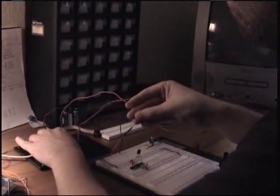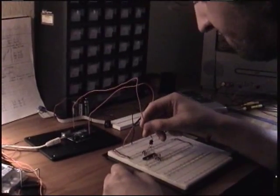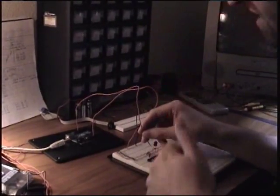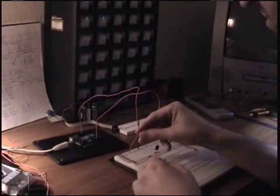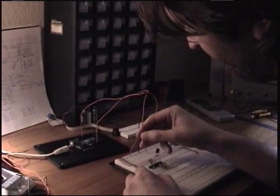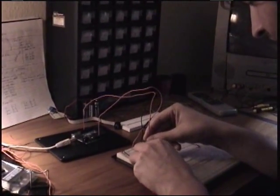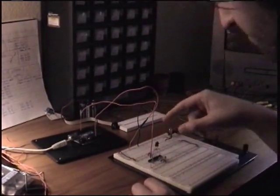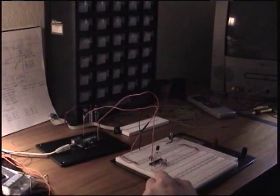And then, of course, as you know from the first tutorial, the reset pin on the actual chip is pin 1. Now, we have the resistor here, and I learned this from experience. It won't work right, at least later when we try to burn bootloaders, if you put the wire after the leg of the resistor. You actually have to move the resistor back and then put it before the resistor. So it has to be sandwiched in between the resistor pin and the actual pin 1 to work correctly. It's an important note.